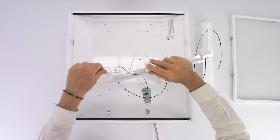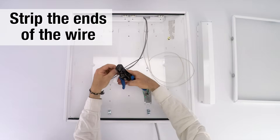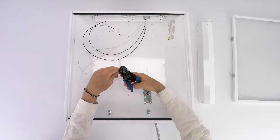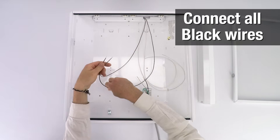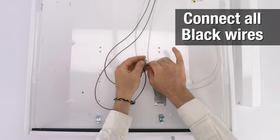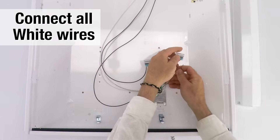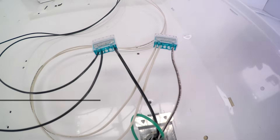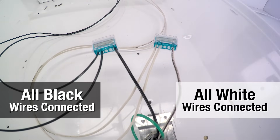Once you've got the plate in and it's all set up, make sure the wires aren't pinched — you don't want pinched wires causing a problem later. Then very simply, we're going to connect all the black wires into this little quick connector. All the hot wires — from our sockets and the hot wire coming into the light fixture supplying power — all get connected with this little port. Don't panic if you're not filling all the holes in the connector; it's okay. We use one connector for everything to keep it simple. Once all the black wires are connected, connect all the white wires with a separate connector. One connector gets all the black wires; the other gets all the white wires. That's as easy as it can be.